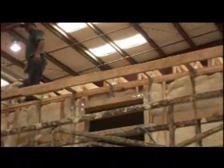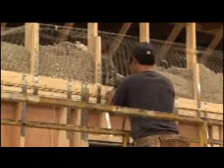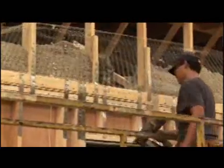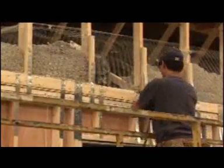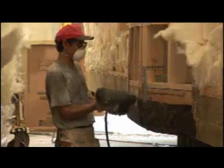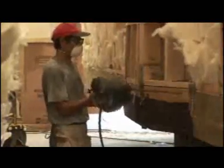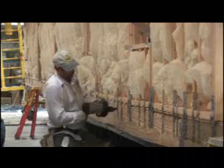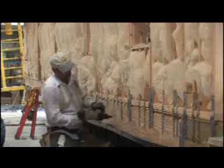20-gauge Simpson Hurricane straps are attached to each roof truss and to the wall stud directly beneath each rafter. In addition to the Simpson strap, another 26-gauge steel strap is added at every stud to secure the roof to the wall and the wall to the floor. These are required to meet the 120 mile per hour wind load that Oak Creek has designed its modular homes to adhere to. Now the home — its floor, walls, and roof — are basically sealed. Homes designed for the 140 mile per hour ratings include an increased amount of straps, fasteners, and clips.